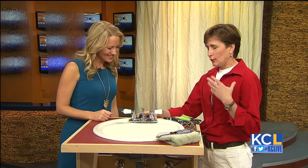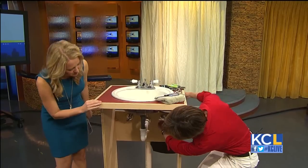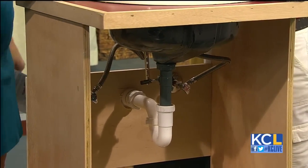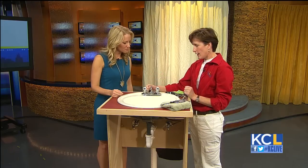We're working on the supply side, where water is delivered under pressure, so we've got to turn the water off first. If you don't do that, you'll have a surprise. Under your sink, turn off the shut-off valves. If you don't have shut-off valves, turn off your main water valve. Either way, stop the water from reaching the faucet, then turn the handles on to get that last bit of water out.